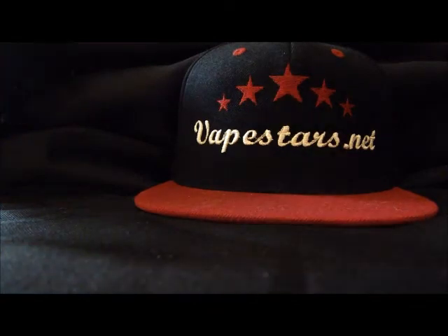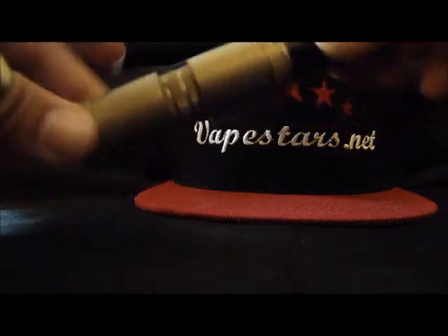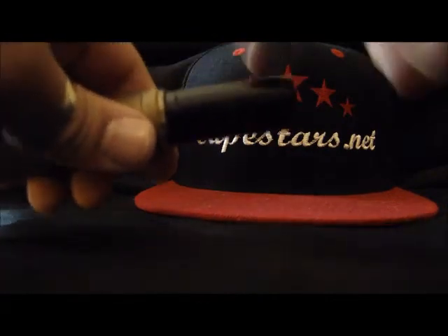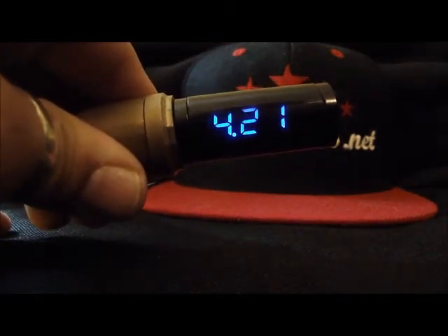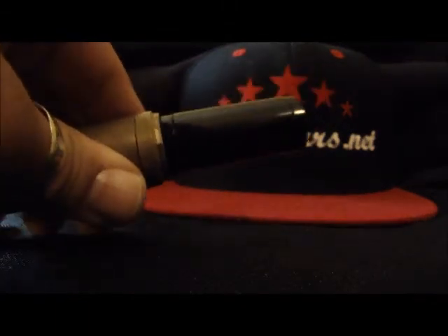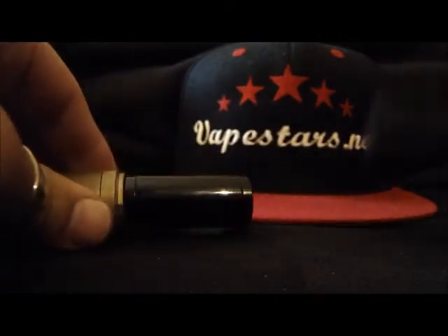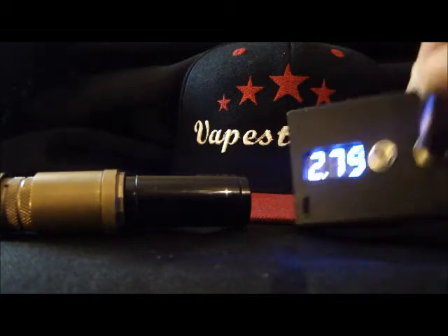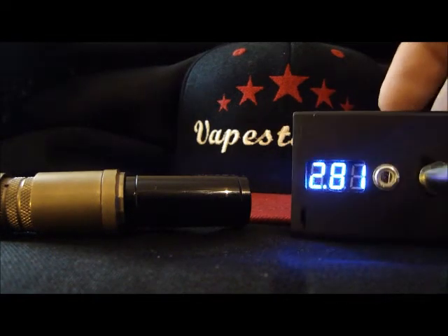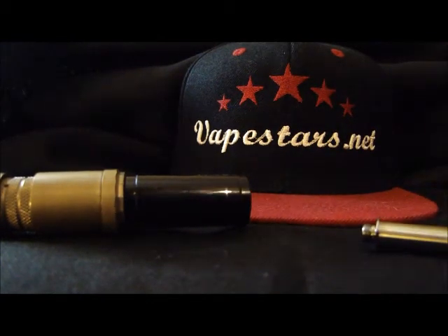So basically a quick test to determine fresh battery. This is an M16 brass clone, just for the purpose of this video. The voltmeter is attached with a fresh battery. That battery has 4.3 volts. By the time it's put out, we're losing 0.9 volts. Not bad — that's not much at all. For the test I use a 2.8 ohm cartomizer as a standard to give me a baseline to run off of.